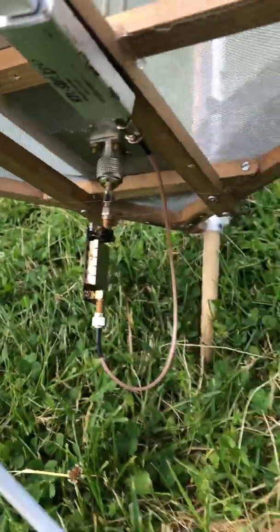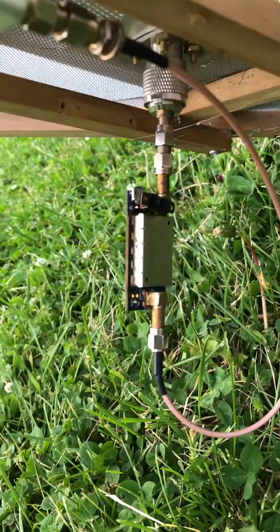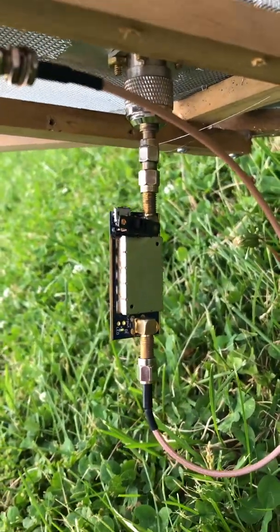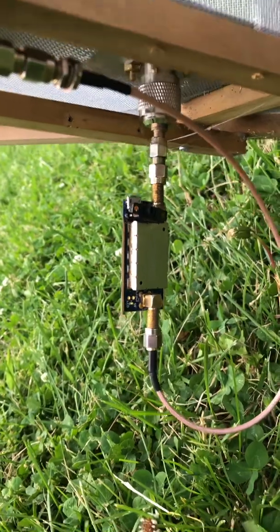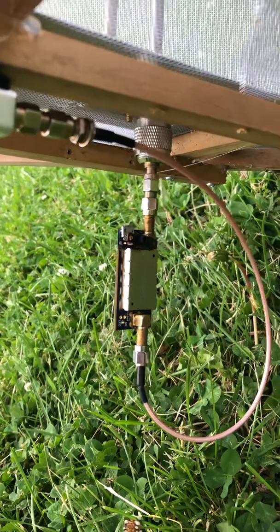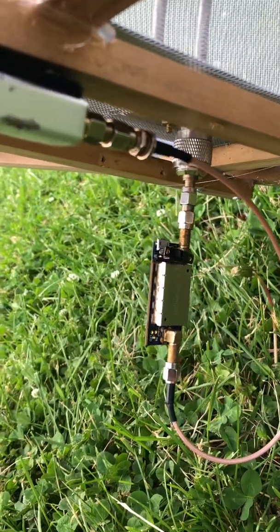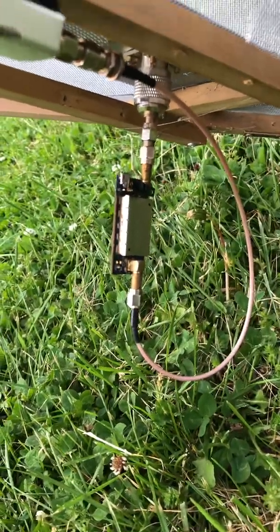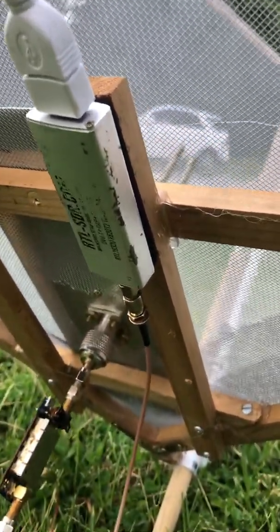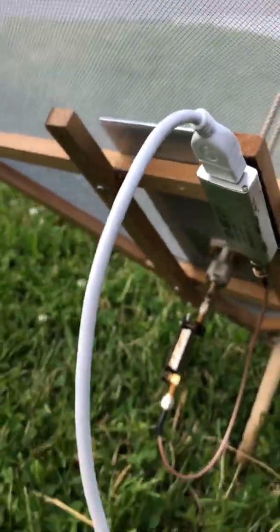Underneath you can see the main components: we have the RF connection to the monopole in the antenna, then we have a low noise amplifier and bandpass filter assembly. It has a switch that allows me to switch in a 50-ohm termination so I can calibrate the system and correct for contributions from the amplifier and active circuitry to get a flat response.